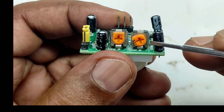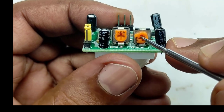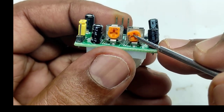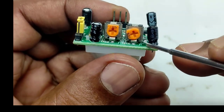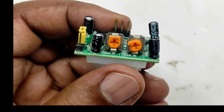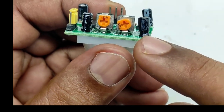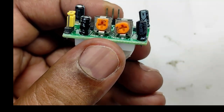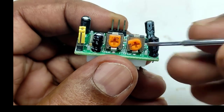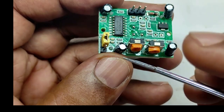This preset is used for adjusting delay time. That means when the sensor identifies a movement, the output will go to a high state, and how long it needs to stay in the high state is determined by this preset. We can adjust it from 1 second to 3 minutes. If more time is required, we need to use a monostable multivibrator using a 555 timer IC. The video link for monostable multivibrator is given in the description box.